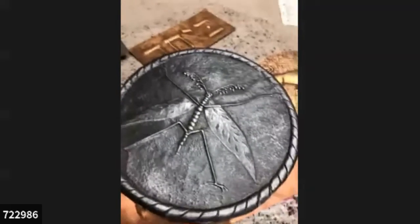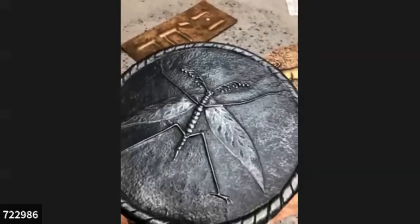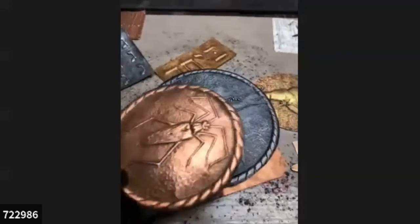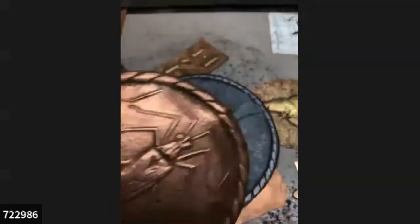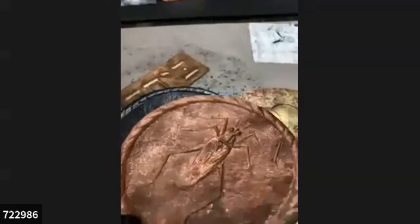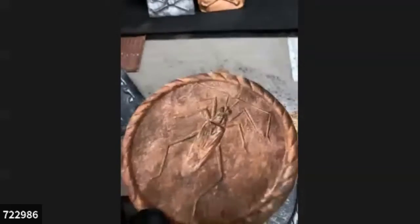Okay, so here it is. No problem. The tiny little tools that I use dozens of to solve each problem are so that I can do both chasing and repoussé. As a quick description, chasing is when you work from the top of the work like this, and repoussé is technically when you work from the back. We simply say repoussé nowadays, because why say chasing and repoussé and waste syllables.